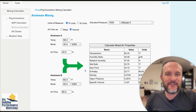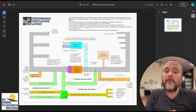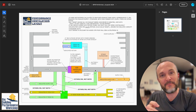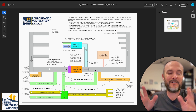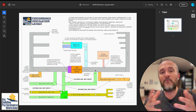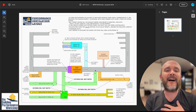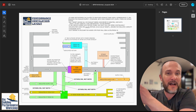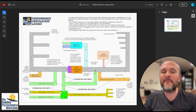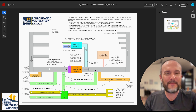So, should we insulate ductwork inside a ceiling or wall cavity? The math says you probably don't have to — if you have a properly functioning air handler, a dehumidifier plugged into the supply side, an airtight home, and a properly tuned ERV. But there are a lot of 'ands' and assumptions in there. Insulating your ducts is a pretty cheap insurance policy, so I'd still recommend doing it. In my own home, I insulated anywhere the ductwork goes into places I can't access later. I hope this has been illuminating — keep technical questions coming in the comments.